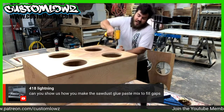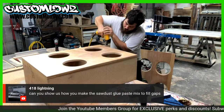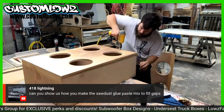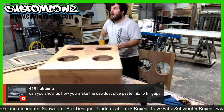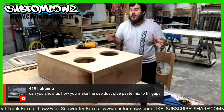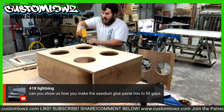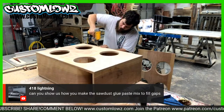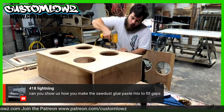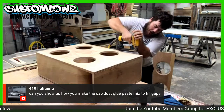The amount of sandpaper you're going to go through trying to sand all that glue you pasted onto your box is going to far outnumber the cost of just buying the wood filler itself. Do not mix sawdust and wood glue as an attempt to do what you have. Maybe you already have a ton of sandpaper that you're okay with blowing through, but generally, don't do it.